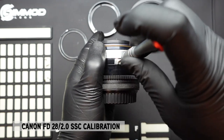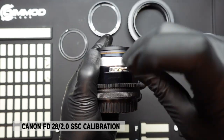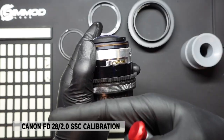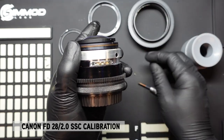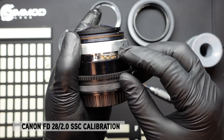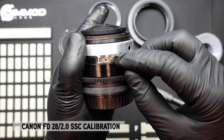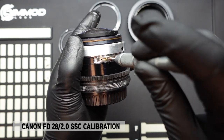We're not going to remove it — I'm just going to loosen the screws. By loosening them, it allows me to move this plate. We'll remove one of the three screws in this instance because we need to shift the plate left. By doing that, we'll be able to shift this plate left or right. You may need to remove that screw to shift it, or you may just need to loosen all three screws. You don't want to lose any of these screws, so don't remove them all.